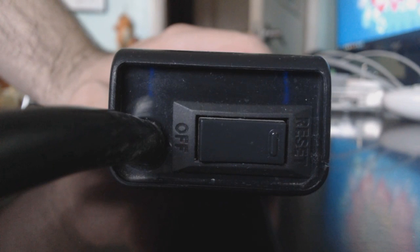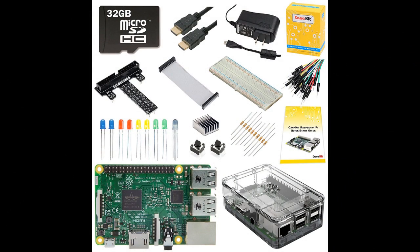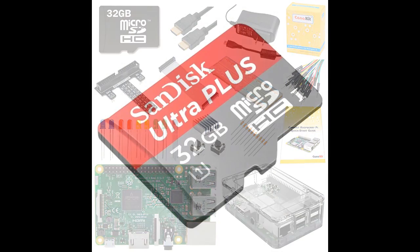Now, one of the other reasons we might not have a power button is because of user error. So if the Pi can't make a button that works with the ACPI standard, why not just do a simple switch that just cuts the power on and off? It gets the job done and would probably be super cheap. Well, the reason they might not want to do that is because people are too used to the ACPI standard. So maybe they would push the switch without shutting it off from the software first, which could break the Pi, and possibly any other hardware attached, especially SD cards.